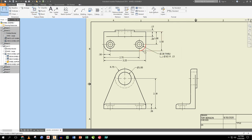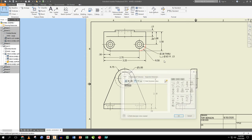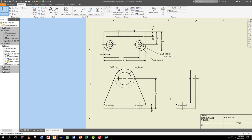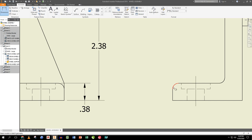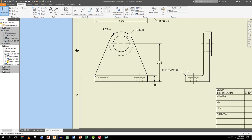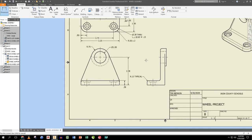I make sure to include the radius symbol. I annotate it as '2x' since there are two of those holes. I can also put a general note that says all dimensions unless otherwise specified are an eighth of an inch. I check whether this side view is needed for clarity — I have some overlapping dimensions here — and I use the fillet dimension, labeling it 'TYP' meaning typical, covering all similar fillets.